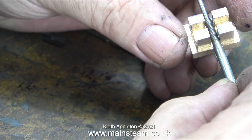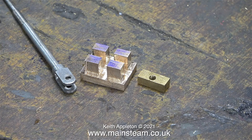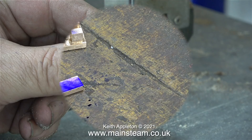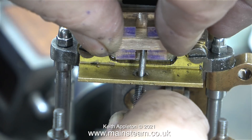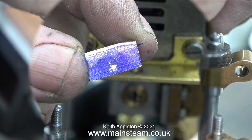I tried a test fit of the valve rod in the valve itself and everything's okay. The original drive block I made is too short so I'm going to make another one that matches this valve. I cut and machined a block to be an easy fit in the cross slot in the slide valve, then coated one side in marking out blue, fitted it into the slot in the valve, and partially assembled the valve in my jig on the engine to make a mark on the marking out blue to show me where to drill the hole.